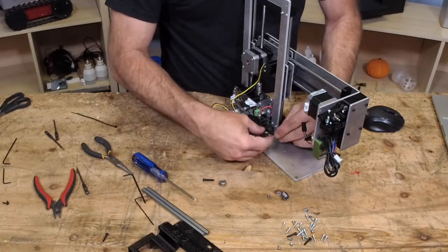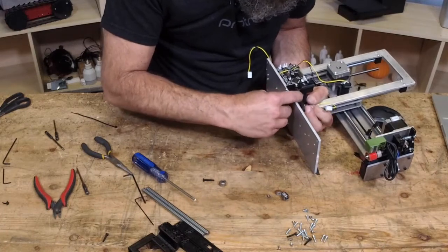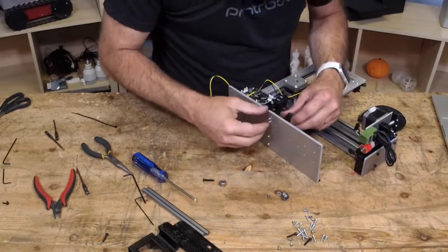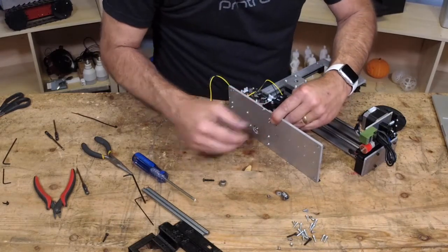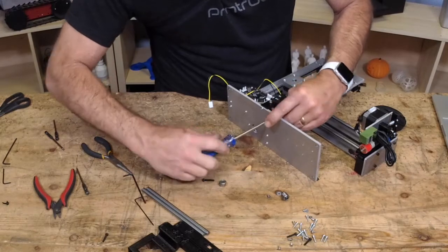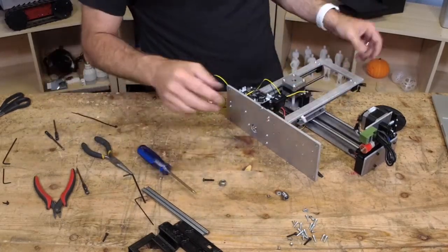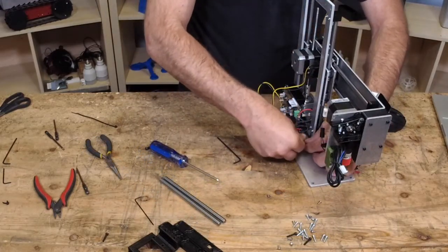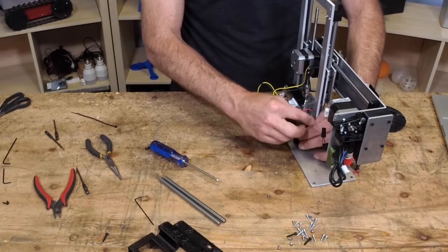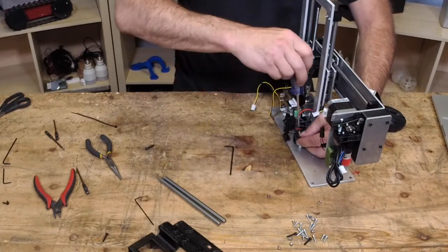There we go. And now two of the plastites under here to hold this on. Okay, beautiful. So two 624s and a washer on bottom with a 16 millimeter M4 is your bearings here. Then you can put your end stop above it.